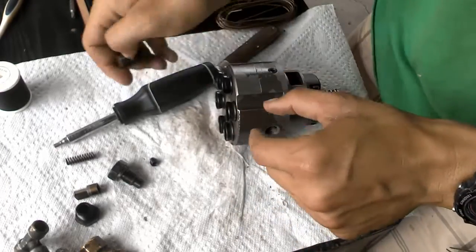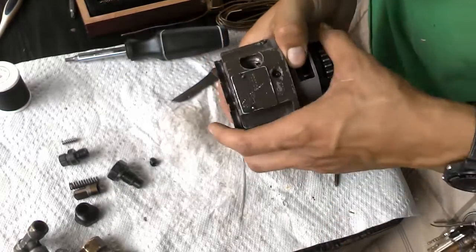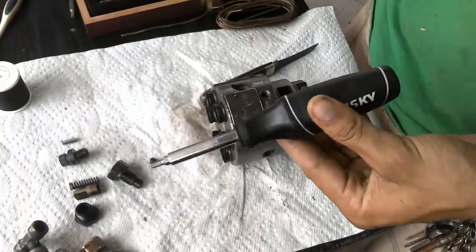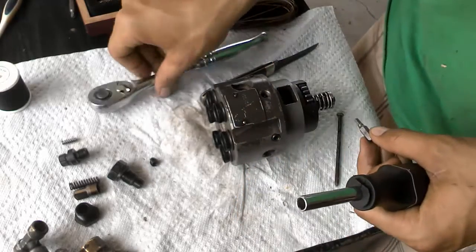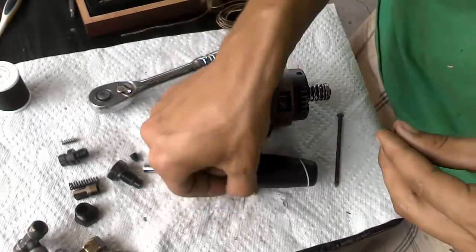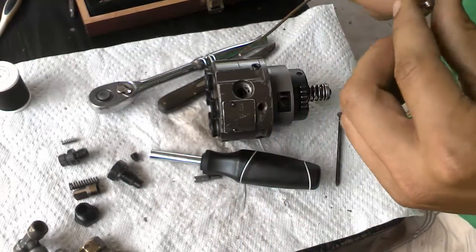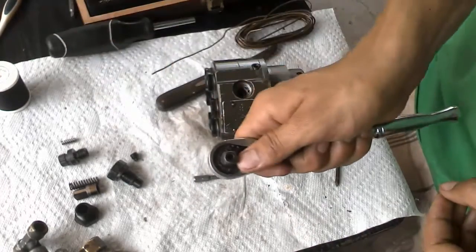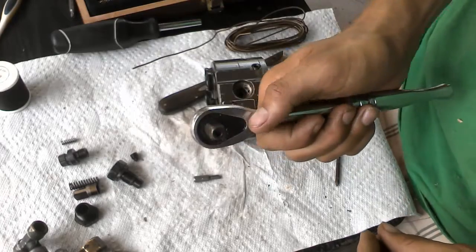Be careful with that. Do not take that off if you don't have to, because obtaining that part on the market is a big pain in the ass, and it's almost easier to buy one of these than trying to get that made. Now, on these maintenance lines, they were quite a bit of a pain. You can try it with this — it also takes a 5/32 hexagon width hole because you have these little nipples in here that are an even bigger pain to get out. You can use an ordinary one if you don't have one with a hole in it, but be careful — you're going to strip it out. You also need a wire that's the same diameter as that to clean out your maintenance lines. I used a ratchet because I needed enough mechanical advantage to break it.